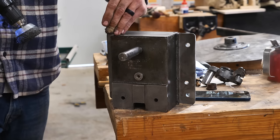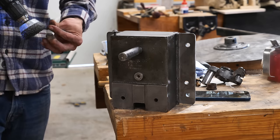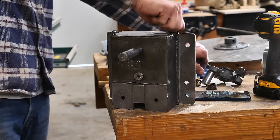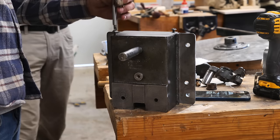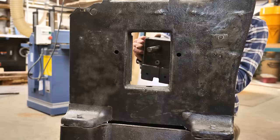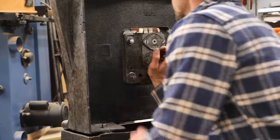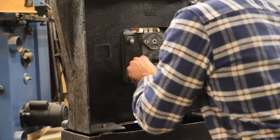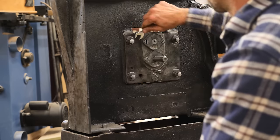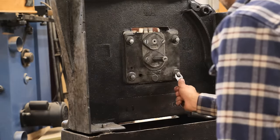Then the lid goes on. Basically it's like an oil bath — you take this little lid off, fill it with oil, probably right to just below the bottom gear shaft, and it allows the oil to circulate up through and keep it oiled. The two holes on the outside of the gearbox are for the motor mount. Now we get it mounted on the body — just four bolts. I love the old bolts, they have a really cool look and shape. They were the same on my old 36-inch Oliver. These machines are actually a year apart — 1925 is the old Oliver, and this little one is 1926. A lot of the components look the same between the two.